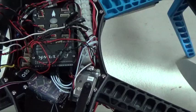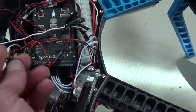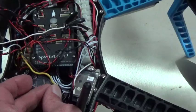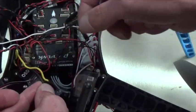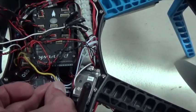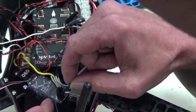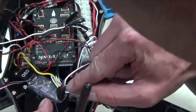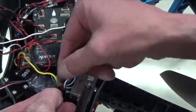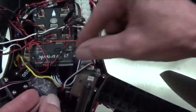Now this is my cable to my GoPro. From the GoPro you're going to go to the very back pins. Video is obviously yellow and that's going to go to the right — just stuff that on there like that. And then on the transmitter, you're going to put that on in the front. Plug her in.